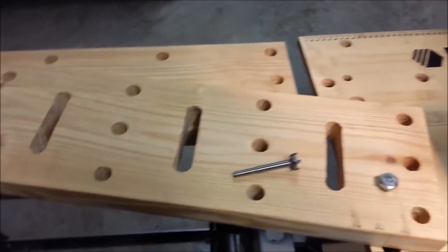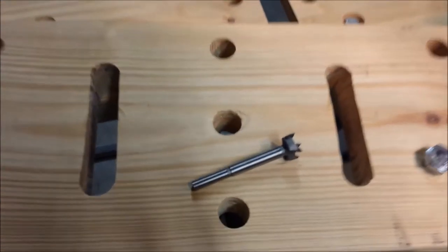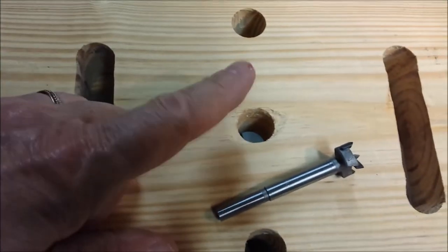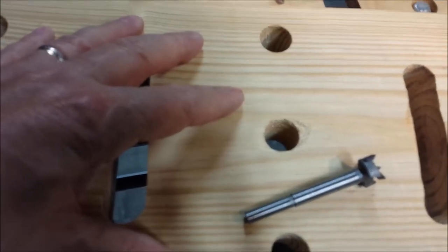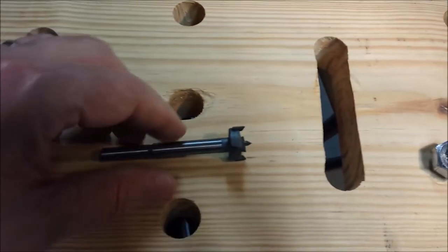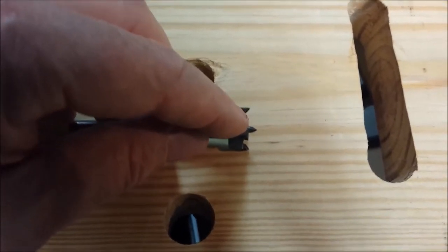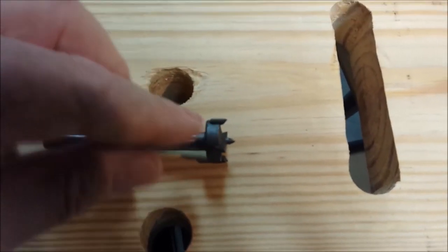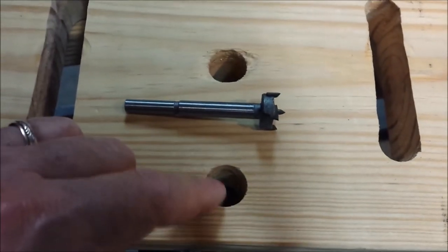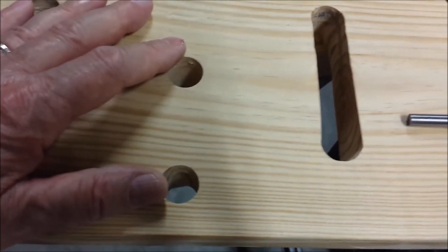The first example I'm going to use is this benchtop that I made from my Workmate 425. I had to drill it out, and one of the things I discovered very early on is if I drilled through all the way, I ended up with some rough edges on the back side, which I didn't want — especially on this piece, because it was to be used on two sides. I was using what's called a Forstner bit. The realization I came to is if I could drill down to the point where just the tip was coming through, and then turn it over and drill back through on that same exact spot, I wouldn't have the same problem. And as you see on the other holes, I didn't have that problem because I controlled the depth with the depth gauge.